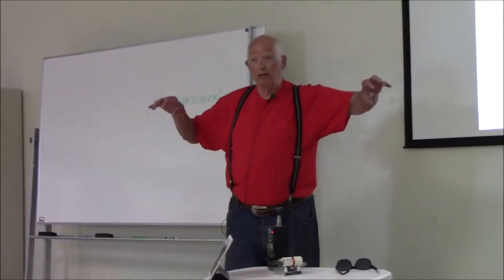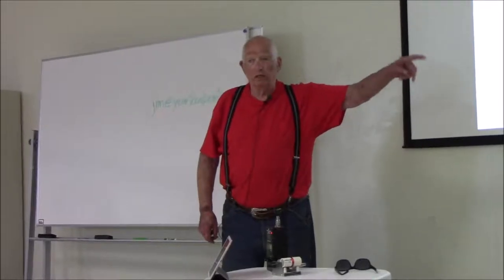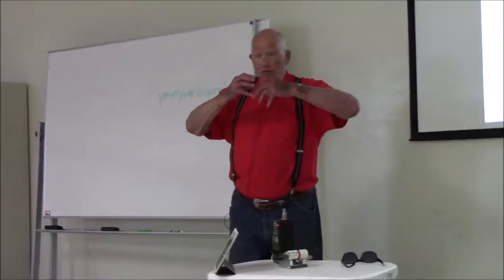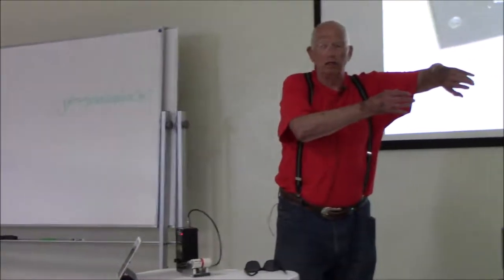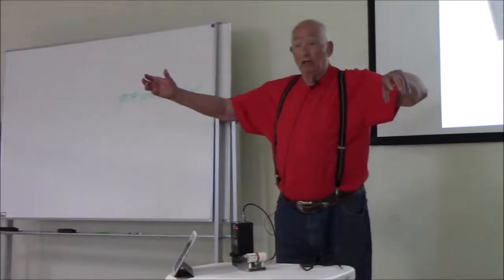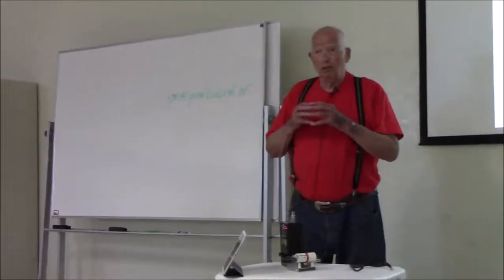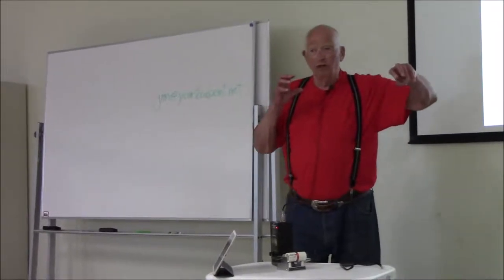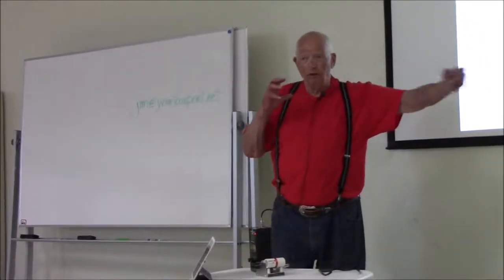And so we've talked about conductors, and the electrons hop along the outside of the atoms in the conductor, and there are more electrons in the conductor than there are holes for them in the atoms. So there are a lot of electrons just accumulated on the surface. If I pull on the electrons at one end of that conductor, they start to spread down and even out again. That's the flow of current. Now, if the material has a limited number of opportunities for electrons to flow, it's harder for them to flow. It takes more voltage to pull them through the conductor.